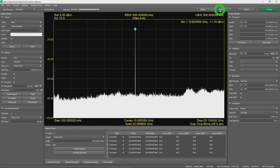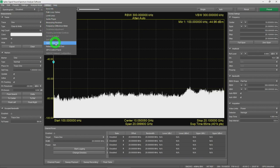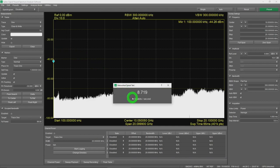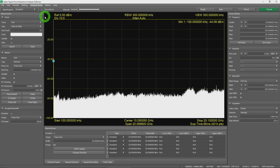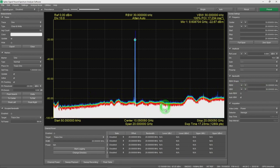To understand the nature of this tone we need to look at it in real time, which is the strength of this spectrum analyzer. But first, let's verify our network connection can support 160 MHz IQ streaming — running the network speed test shows we can maintain 8.8 Gbps transfer rate, confirming 160 MHz streaming is possible. Going into real-time mode, we sweep from DC to 20 GHz in under 17 milliseconds at 300 kHz RBW — and even at 30 kHz RBW it's still around 17 ms.